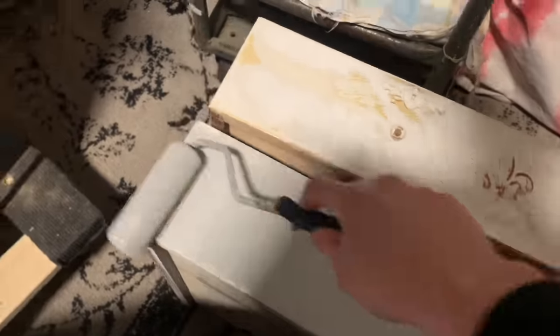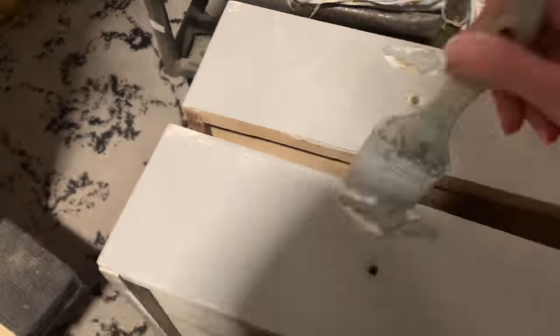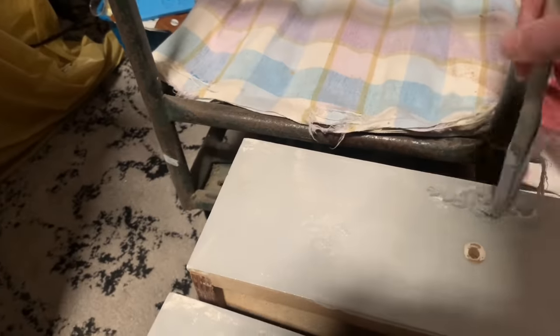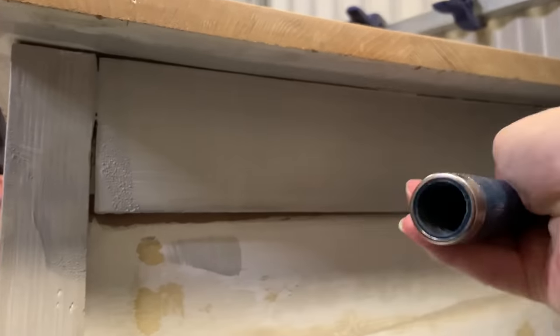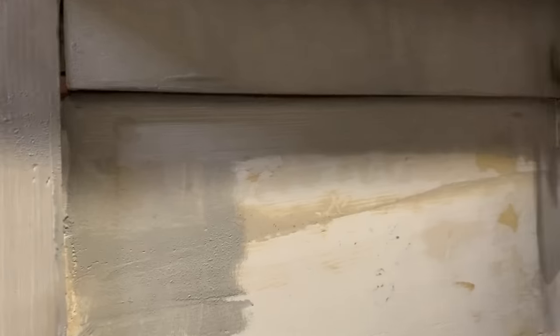Now, if I didn't have molds on this piece I probably wouldn't have bothered to prime it, because the paint in itself would have worked as a decent primer — no adhesion issues and no bleed through. But since I did the moldings, I don't like painting directly over those without a primer because I find that it doesn't adhere right. So we are now priming the entire piece.